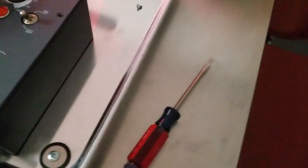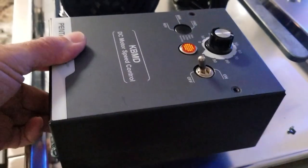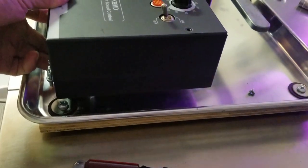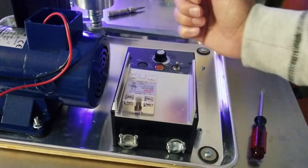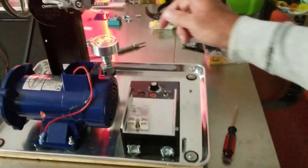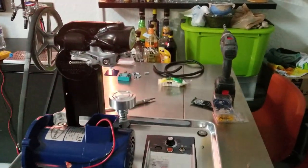I'm going to have the box on standoffs so the electronics don't end up soaking in beer — that would not be good. So the box is going to be standing off the tray sort of like that. And then my final box is going to have the relay in it. I'm actually going to mount it to the top of this box, maybe offset a little bit. The green button will sit on the top of that — you'll hit that once, and the motor will go around a revolution of the canning system, which is multiple revolutions of this wheel here.